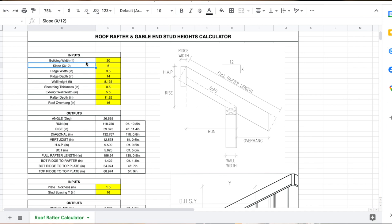You have to select the roof slope you want, the width of your building, the height of your side walls, the width of your ridge beam, and how much overhang you want. After that, the spreadsheet spits out a lot of valuable information about the rafter. The full rafter length is quite important — you need to make sure you order the right size. It also gives you the height of the ridge to your top plate.